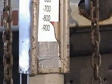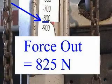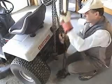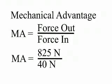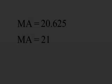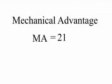Lifting the tractor clear of the ground, I see we have generated a force of 825 Newtons. Mechanical advantage equals force out divided by force in: MA equals 825 Newtons divided by 40 Newtons, which equals 20.625 and rounds to 21. Our chain block has a mechanical advantage of 21.